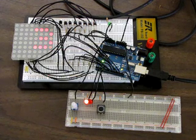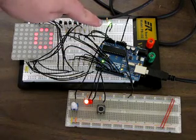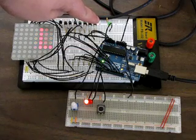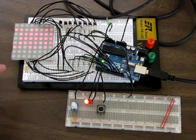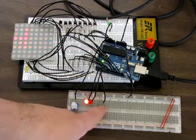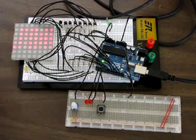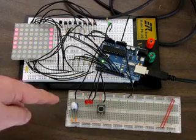And once it reaches 0, it will basically be in a launch state, which is signified by this green LED being lit. And that will activate the relay, which will launch the rocket. And you can see that the display now goes to launch from pad 2, so saying that the rocket was launched. Now, if I hit this next state, it basically goes back to the original state. And notice the LED reset because it's tied to the potentiometer.